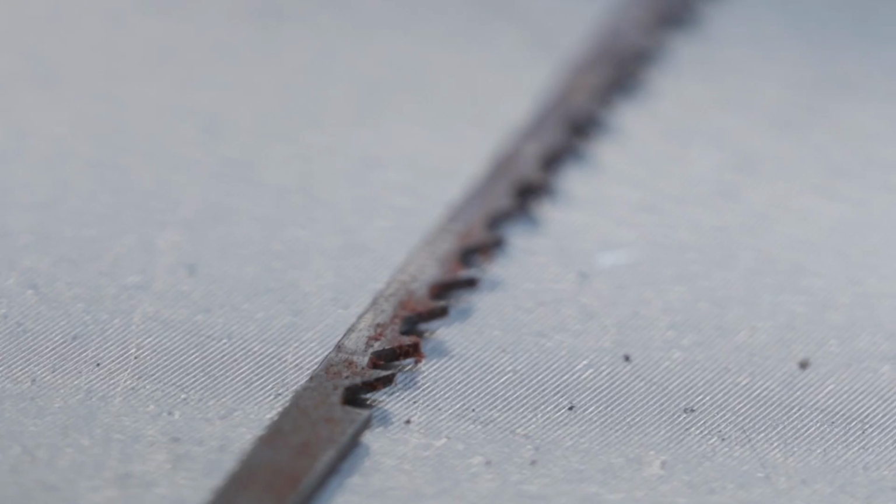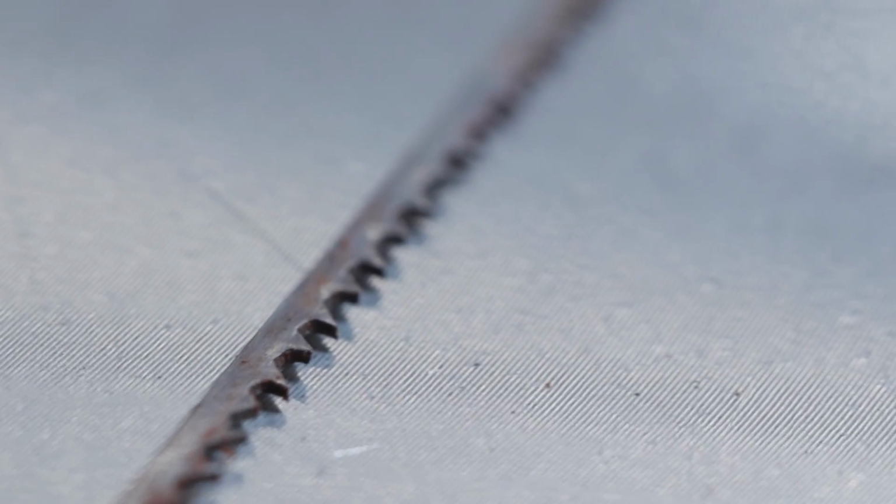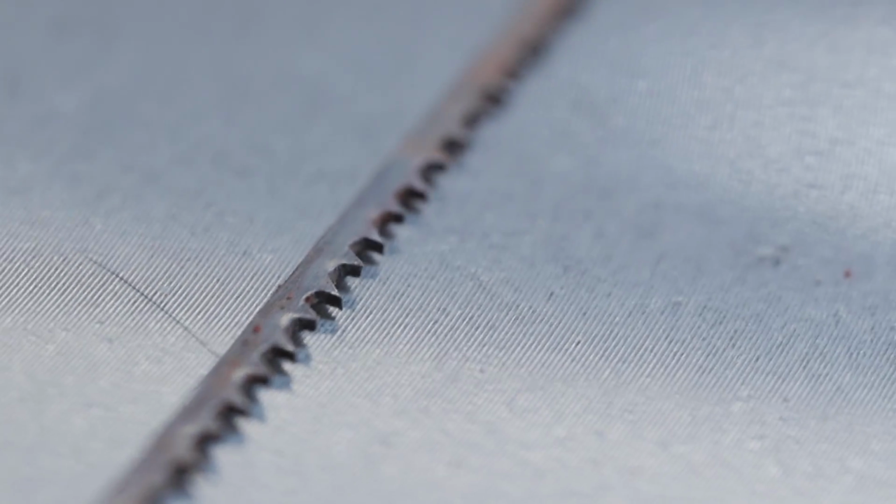Oh yeah, well the good news is nobody knows. It's always a mystery that you gotta kind of figure out. Okay. The blade size and the teeth per inch all are determined by what material you're cutting. Okay. So what I primarily use is called a reverse tooth blade. So the bottom half of the blade's teeth point up so that it cuts the bottom of the workpiece cleanly, and the top points down to cut the top of the workpiece clean.